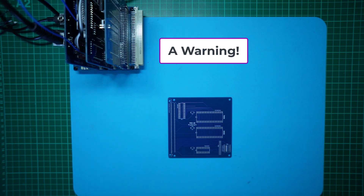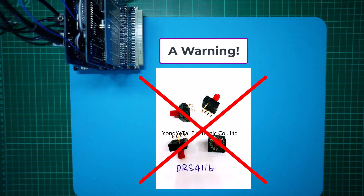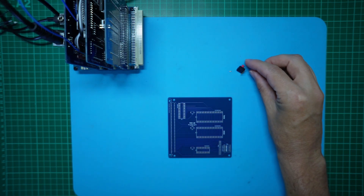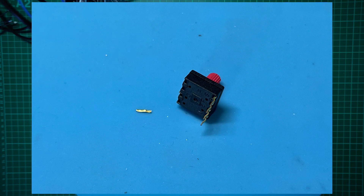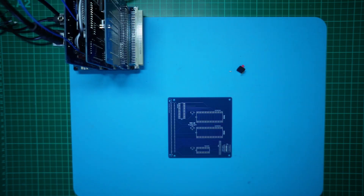However, a warning regarding where you source these from. I found a good price for some 16-way switches on AliExpress. Because of the shipping cost and having used them in other projects, I ordered a large quantity from the AliExpress supplier. What a mistake. They appeared OK on receipt, however when I went to use them, the legs just break off when trying to insert them in the PCB. The pins seem to be made of an incredibly low quality metal that just breaks on the first sign of even slight bending. This also raises the question of whether the rated 20,000 switch operations is actually believable. This was unfortunately a quite costly mistake, and since I didn't discover this quality issue until over 14 days after receipt, I had no recourse via AliExpress and I couldn't even post a review to warn others. So please be warned.